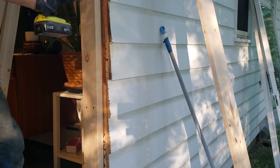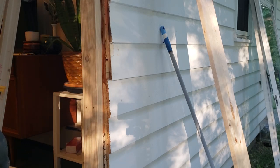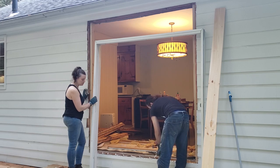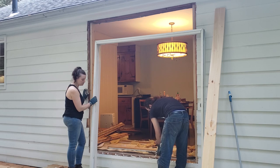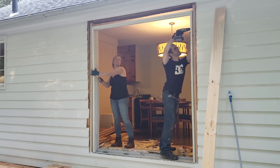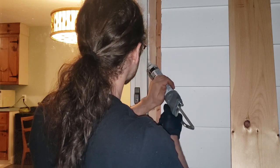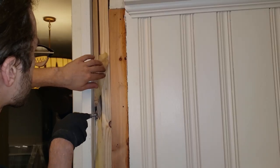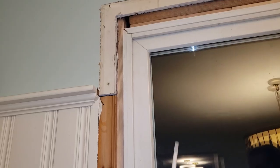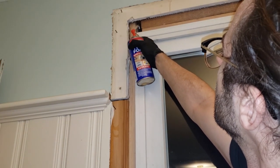From here, we built up the frame using 2x4s to conform to the size of the sliding glass door frame. Then it's time for the frame — but just before you do that, apply some caulk to really seal out that water along the edge of your hole. Attach the frame to the frame-out you made with the studs. We filled remaining gaps with more studs, and any smaller gaps get covered in caulk. Make sure to stuff fiberglass using a spackle knife into any of the gaps for insulation, and for the larger gaps, just use expanding foam.